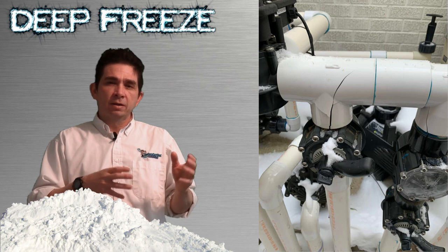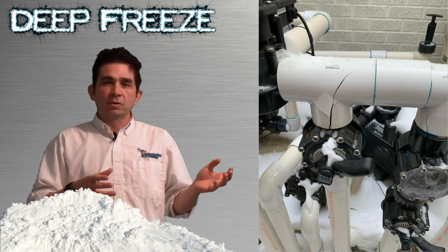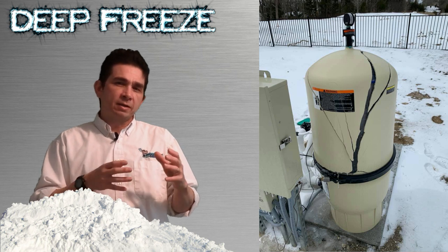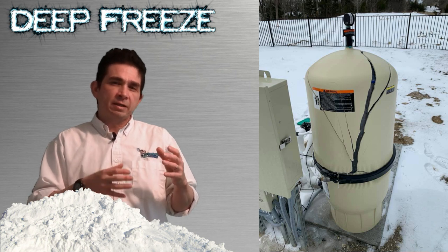As far as any visible cracks in the plumbing, you definitely have to replace that part. And of course, if your filter has visible cracks, that has to be replaced too. But again, you may not see the damage to the filter immediately — if it did freeze, you may need to replace that component.